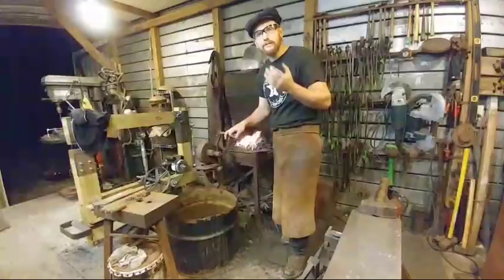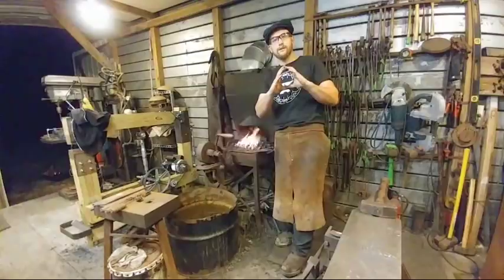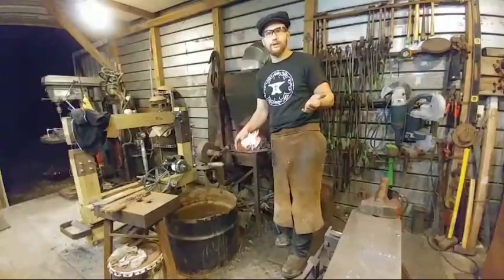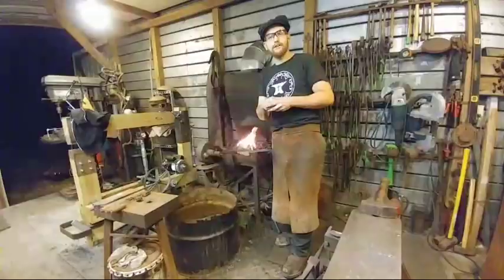Essentially, they're pieces of 1-inch rod cut off exactly 1-inch thick. So they're 1-inch diameter rod cut off at exactly 1-inch thick. And that's put on a solid steel cam, with a solid steel outer shell, and then they're greased real good. You're not going to wear them out in your lifetime. Well, they may have more slop in them, but since it's homemade, it's very easy to cut a few tack welds off the cam sleeve and just replace them with some new low-cost 1-inch rod.